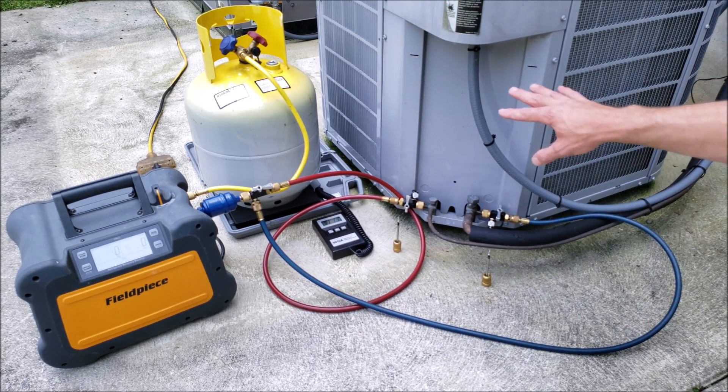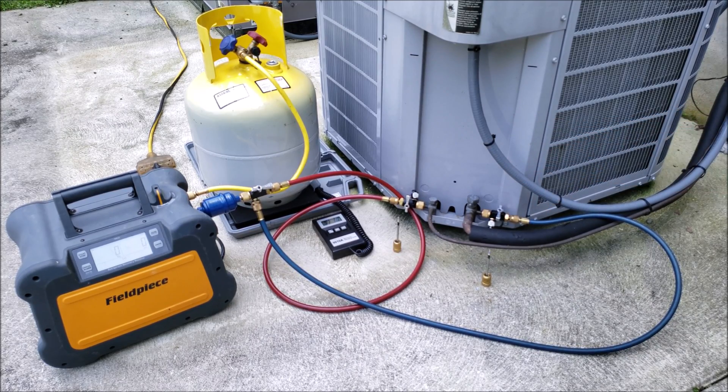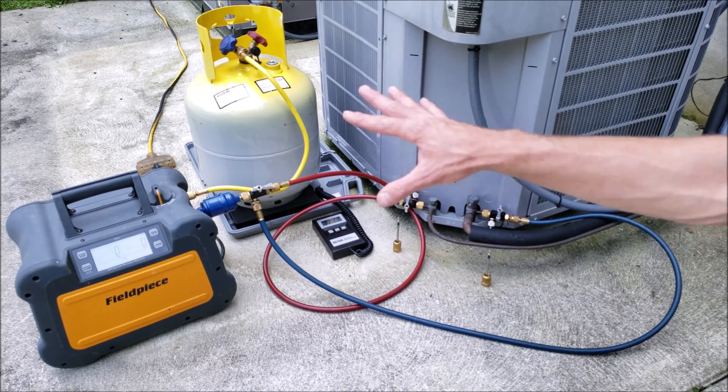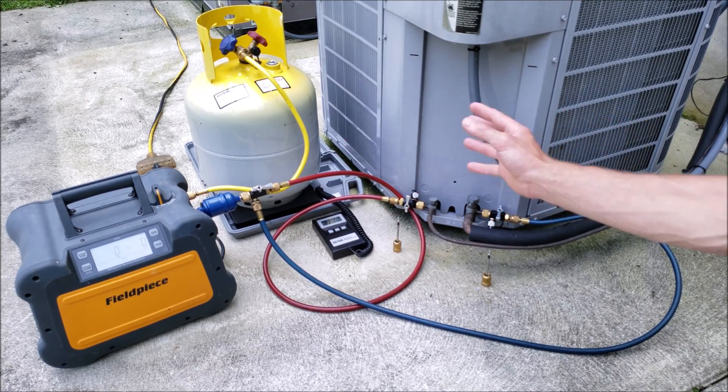We're not going to be removing much oil from the system, and that's because while the system is running, the refrigerant oil and the refrigerant are thoroughly mixed and that mixture is heading to the inlet of the compressor, then coming out in the discharge line. When the system is off, the oil accumulates at the lower positions of all the tubing. So when you're recovering the refrigerant with a recovery machine while the system is off, you're mainly just recovering the refrigerant and not much refrigerant oil — which reduces oil loss from the system.